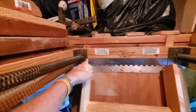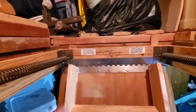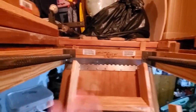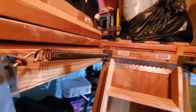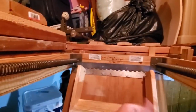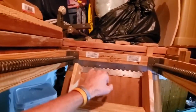They also normally will allow a quarter-inch lag screw. And especially with the newer torque screws and structural screws and stuff like that — I'm sure those work just fine as well. I'm sure most manufacturers will incorporate those into their installation instructions. Most of them do say a quarter-inch lag screw, which I guess the structural screw would be considered a lag screw.